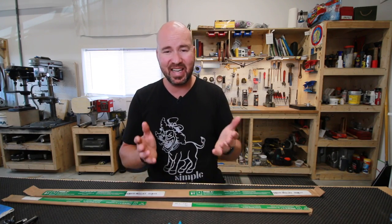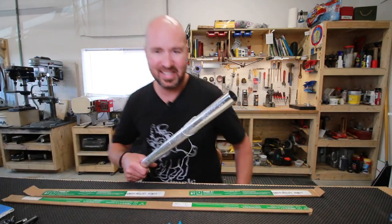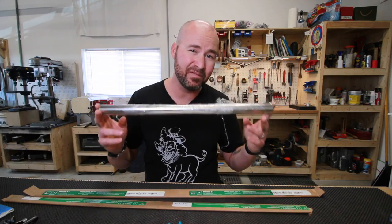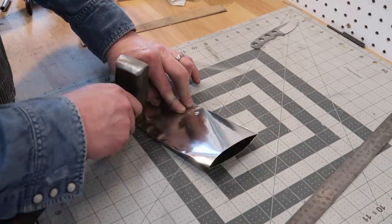Now, one way to mitigate this, and it's probably the most common with small scale knife makers, is to create an inert environment. And we do that by using a stainless steel tool wrap foil, and we create a little envelope, a little pouch to put the knife into. I'll show you. So this here is 309 stainless steel foil wrap, and this stuff is expensive. 20 inches wide, 20 feet long is $150 Canadian. Very expensive. This is not just aluminum foil.